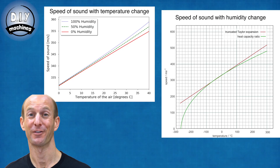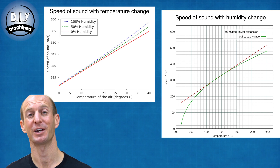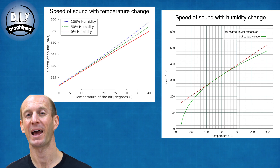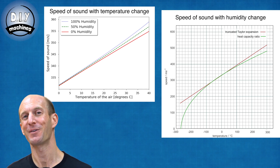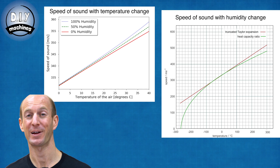The fourth one is high ambient noise. This could be usual sound waves or other ultrasonic sound waves making it hard for the module to detect the ones that it is emitting and receiving. This is part of the reason why it sends eight pulses — so it can look for this signature in the returning sound waves. The fifth one is extremes of temperature and humidity: the speed of sound through air will change in extremes of either of these values. It's not a problem if you measure and account for it in your program, but it's certainly worth knowing.